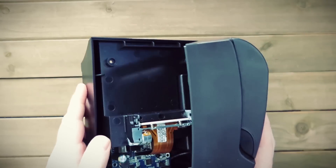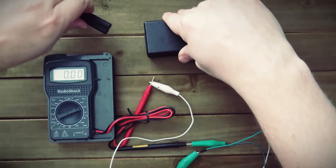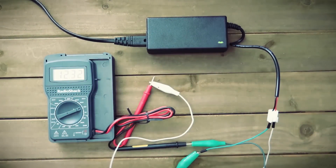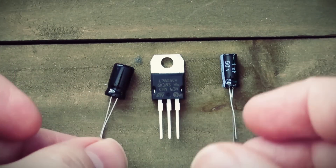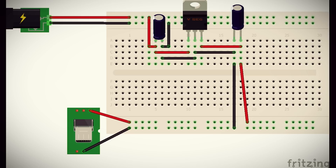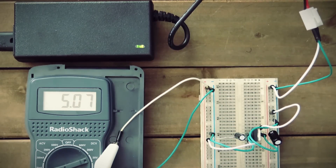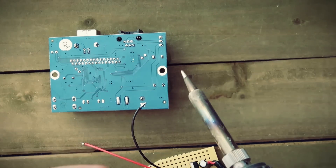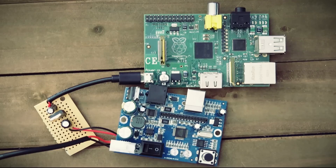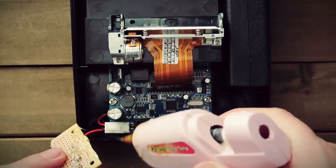First let's crack open the printer case and see what we have to deal with. It looks like we have a very simple power supply connected to a very simple logic board. Let's verify the voltage that the power supply outputs using a multimeter. To drop it from 12 volts to 5 volts, we're going to be using a 7805 voltage regulator and a couple of capacitors. I'm going to put everything on a breadboard first and test the output voltage. Once I verified the output voltage was correct, I soldered everything to a perf board and soldered the input wires to the on-off switch into the common ground on the logic board. For the output, I connected the wires to a 5-volt USB wire adapter.